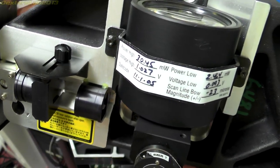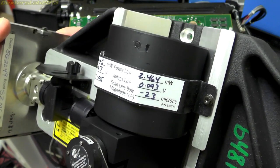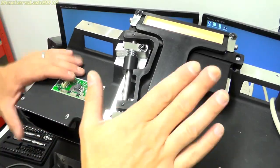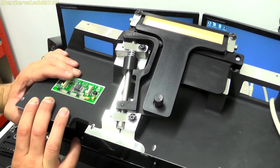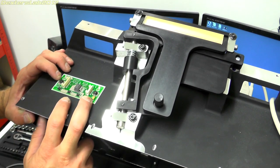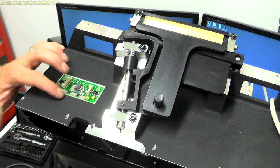You can just see there some of the laser specification: 30.45mW, date code 11, 1st 2005. So we've got power high and power low - it's obviously controllable in its output power. We've got this tilted back up onto its top, so we have that adjustable mirror arrangement which mounts the beam down onto the imaging plate. There's a small board here, which sat in line with one of the control boards and the laser module, and it's called the laser pre-reg board - quite an interesting little board. There's just some diodes on it and an LM2991 on it, so I wonder whether that was some kind of afterthought.